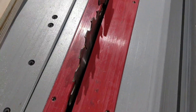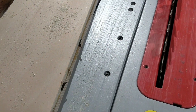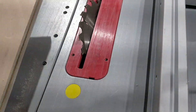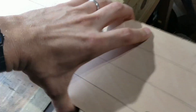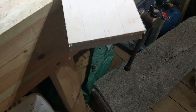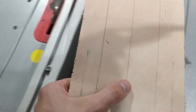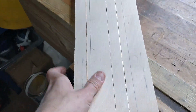I'm going to raise the blade up and flick it to the angle I need. The way you do this, you can effectively cut two cleats in one go — set the angle on the blade, run it through, and you have one side and then the other. I'll end up with two pairs of cleats. This line will be cut at an angle one way, this line at an angle the other way, then I split down the middle — two pairs that will perfectly overlap one another. One piece of wood split in half, the halves cut at an angle, and now this slides along here like a drawer runner.